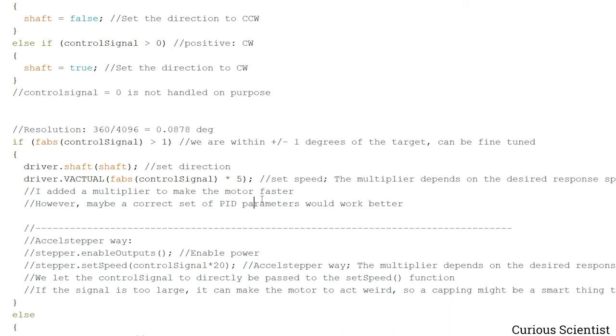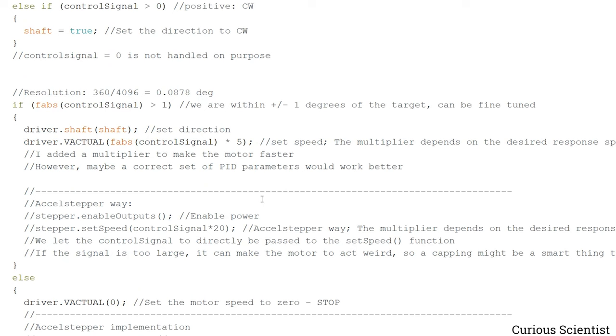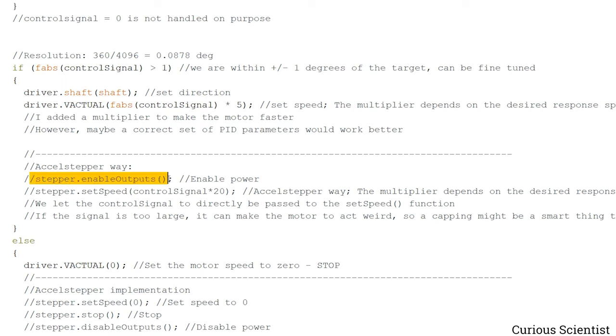And if you want to use the AccelStepper library instead of working with this TMC, then you can remove these two lines and remove this here, and simply uncomment these two lines. So this one enables the motor and then sends the speed. The AccelStepper library can actually take negative numbers in set speed, so you can directly pass the control signal. And then I use the 20 times multiplication factor here, because that's what I considered a good value. So the motor moves really fast and responds really fast if you, for example, turn the shaft by hand. But let's get rid of this now,